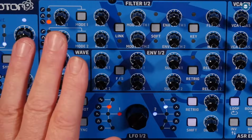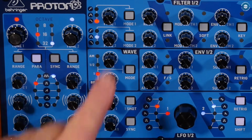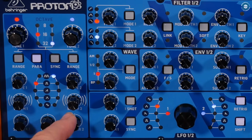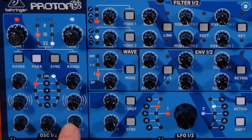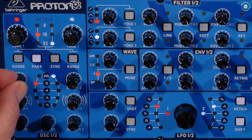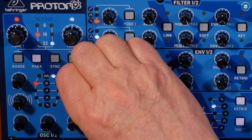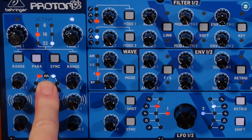Coming over to this side, we've got the same 3340 based oscillators. The layout's ever so slightly different because we've got some slightly different functions. Primarily, we've got the Sub Oscillator here, which has got a rotary mix control. Far to the left is just the sub. Hard to the right is just the core oscillator. We can also do the same thing where we've got the switchable waves, or we can sort of blend between them. The only other difference is this top tone wave.